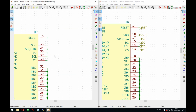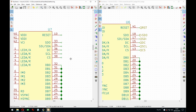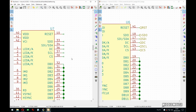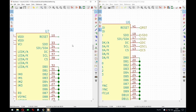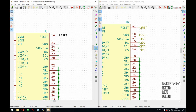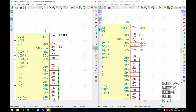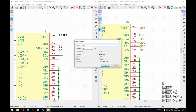These are the easy ones. I'm really torn if I need the pull-ups on the CS. I usually don't do it, but it's because I was using all the peripherals on the board, because it was my board that I knew exactly what to use for. But maybe we need a CS in case someone doesn't initialize the GPIOs. Yeah, let's do that. So let's start here. I type faster than the window can open.